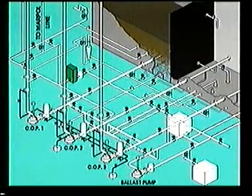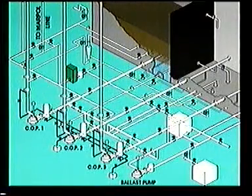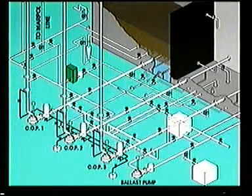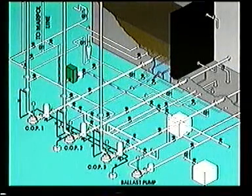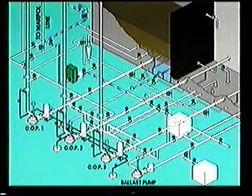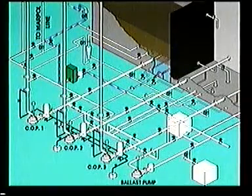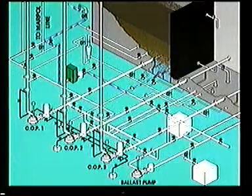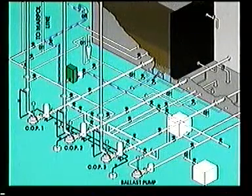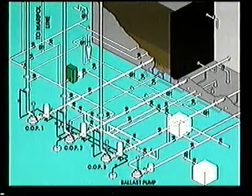Next, flush all pumps and pipes with clean water. Consider the whole pump room dirty and flush all pipes to the starboard slop tank. All the time, watch the available space in this tank. Finally, the bottom of the pump room is cleaned and the stripping pump is flushed with seawater. The whole tank cleaning is completed, and now you have only to let the slop settle to be able to get rid of as much clean water to the sea as possible. There should always be a certain volume of water left below the slop.